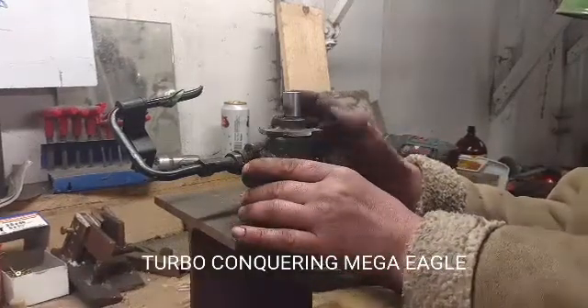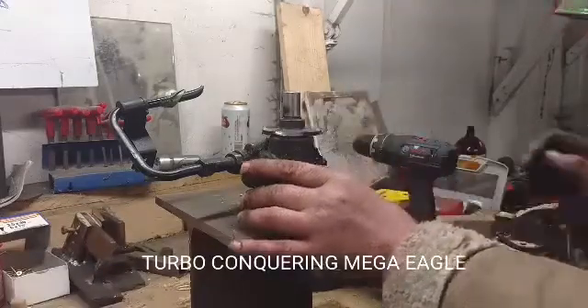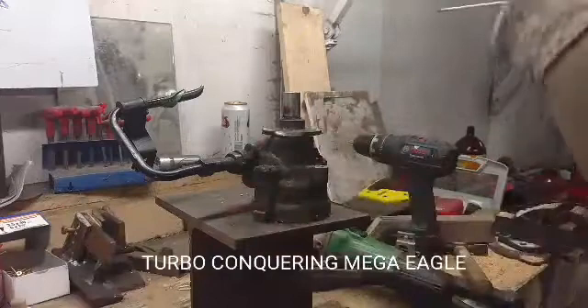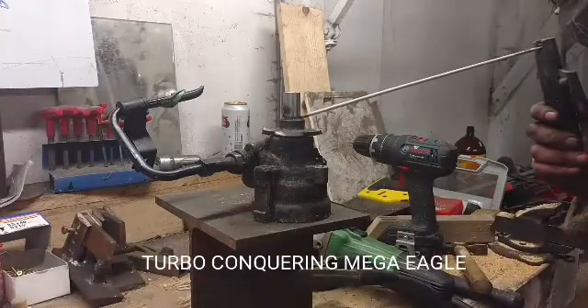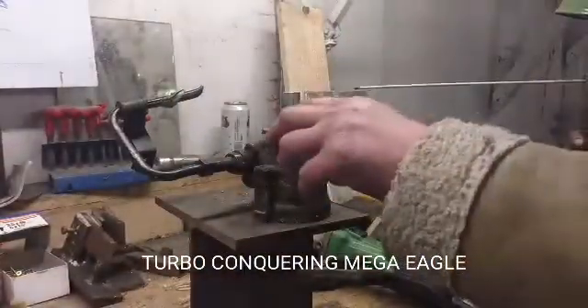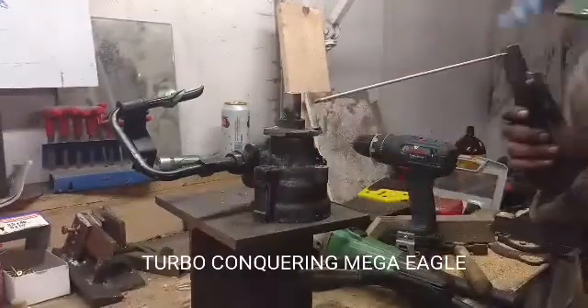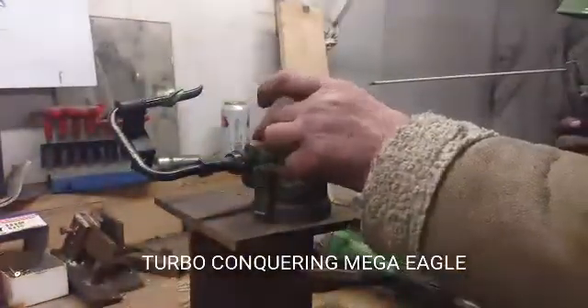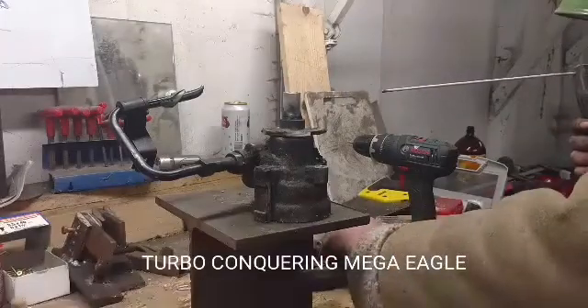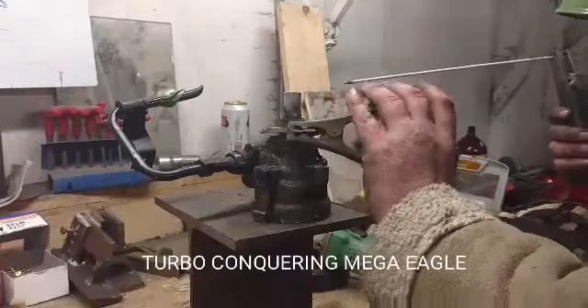So I knew it wasn't going to work straight away. I altered the pin on the back of the injector so it would open at much lower pressure, but this obviously upset the spray pattern. The beautiful thing to me about using an injector is that regardless of what pressure you put in, it will always atomise the fuel perfectly. You can have a very small flame or crank it right up and have a very large fire.